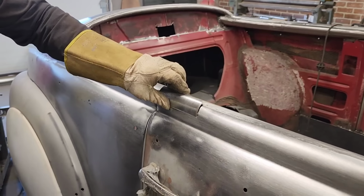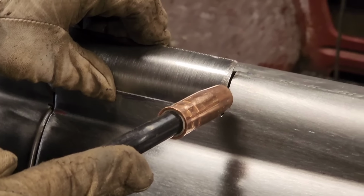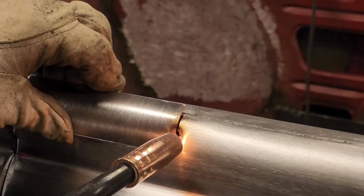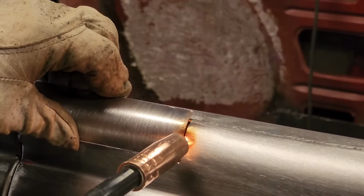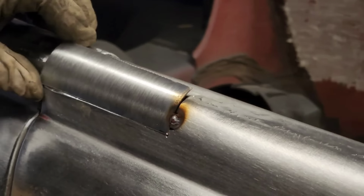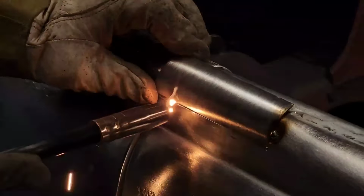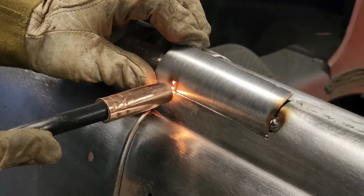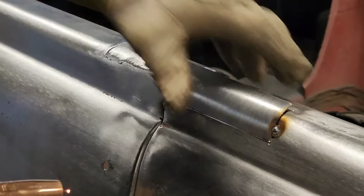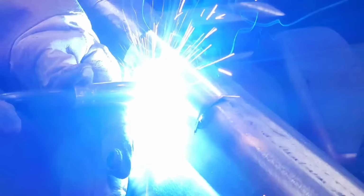Now, let's stand that up a little bit. As you can see, it's got a sharper bend on it, and it's a little thinner. Ran a hole through it, didn't I? Basically putting metal back in the car where it was before I decided to. So that tells me that when I weld pieces on, I should lay a little bit of metal first and then weld it.